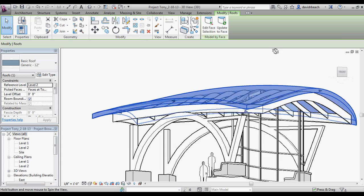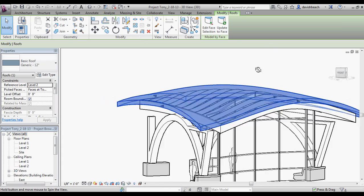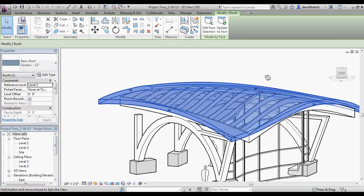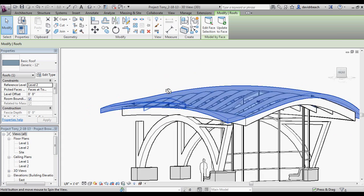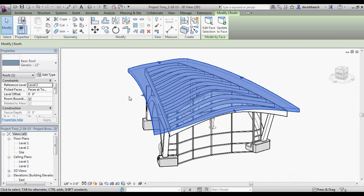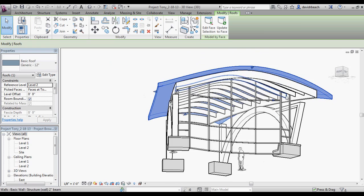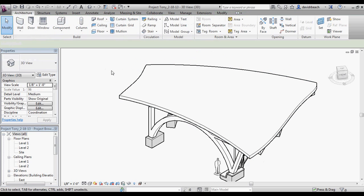And in terms of model materials, maybe we could cast this with something. Maybe we could paper mache it. Maybe we could run it through a CNC router and get the form from a subtraction process. We could whittle it out of a piece of oak. But this is where 3D printing for a scale model comes in really handy, because this is exactly the type of thing that works great for a 3D printer. The problem is that we have an extrusion printer. So we can't just build this arbitrarily. We need a simple edge to be able to build up off of.